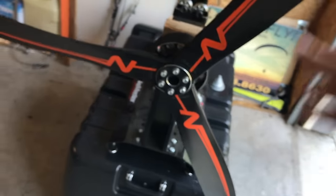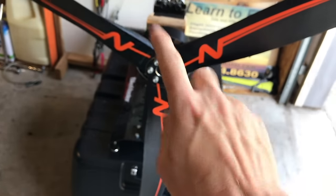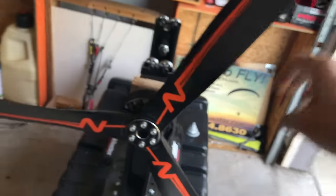This one had a little bit of damage here, so we put some epoxy on it, sanded it, and had to add a little bit of weight to both blades to even it out. You're probably going to have to add about the same amount of weight on each of the other blades depending on how yours ends up. If yours balances out with a heavy side, you're going to have to add weight to both of the other blades. Or if the light side is on top, you'll only have to add weight to one.